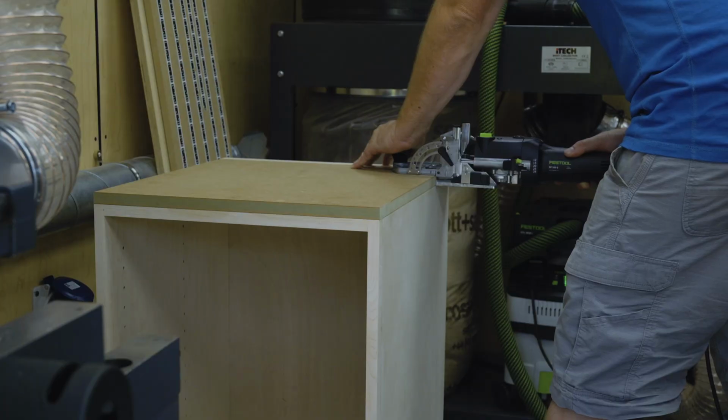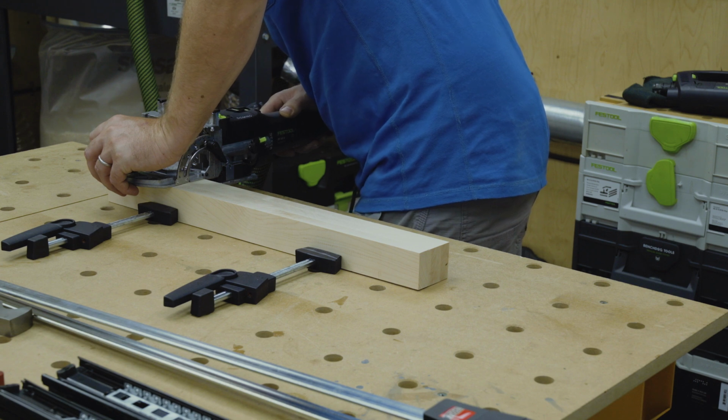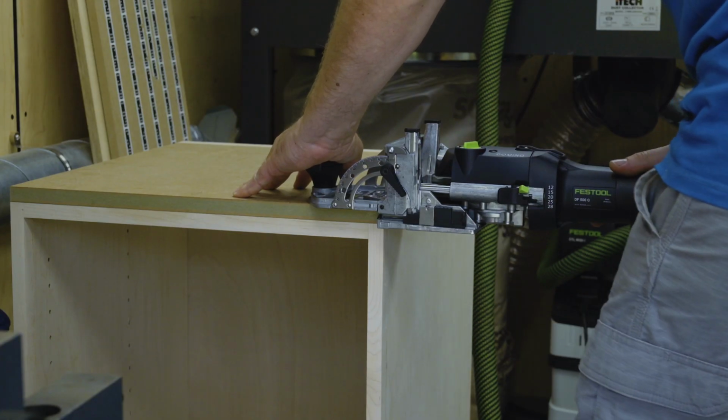To attach the bumpers to the top, the fast option is to glue and pin, but as I didn't want any visible fixings in the maple, I went down the domino route, where I used 5x30 dominoes and a combo of the tight setting and the medium loose setting to give me some error margin.